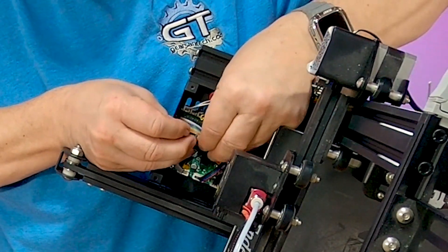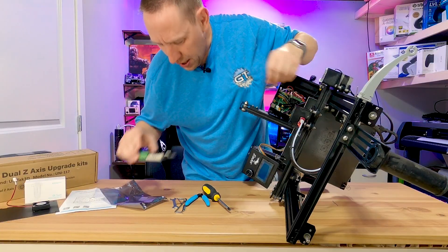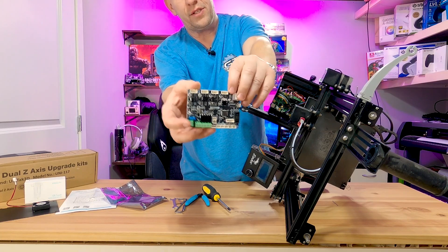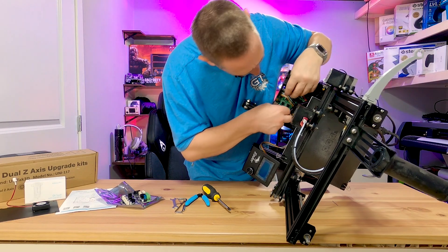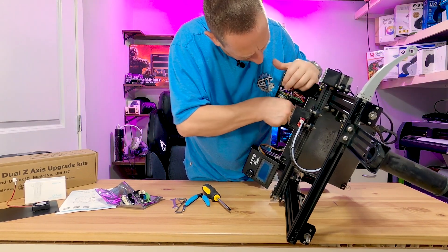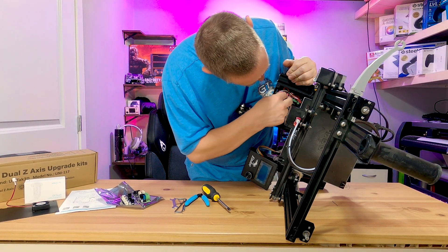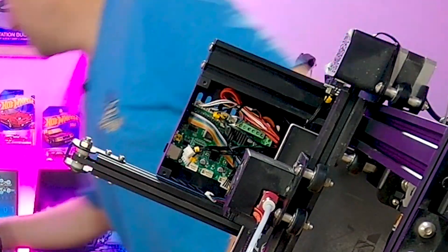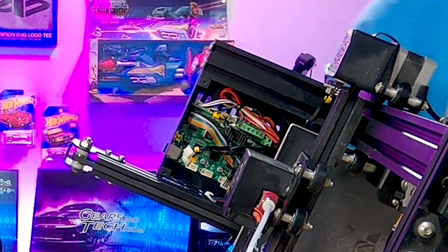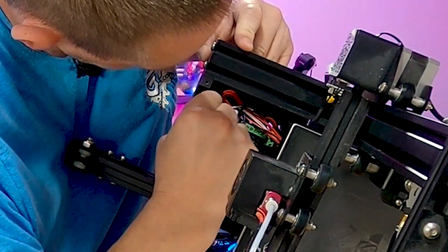Make sure all your wires are labeled. My wire tags are all labeled, so E matches up with E on the new board — I know which wire goes where. If you're not sure it could create issues with your reinstallation. This part's getting a little sketchy, so I'm going to take a picture of it before I keep unplugging these.